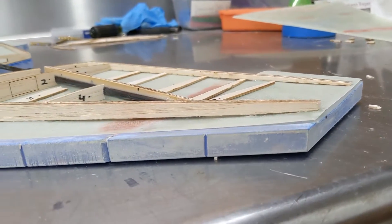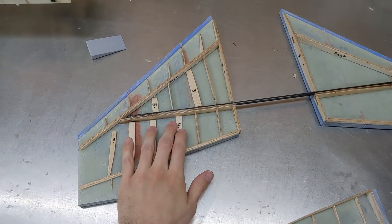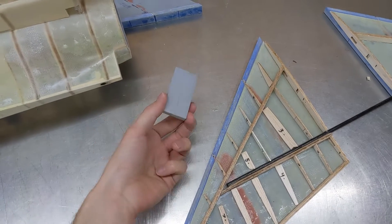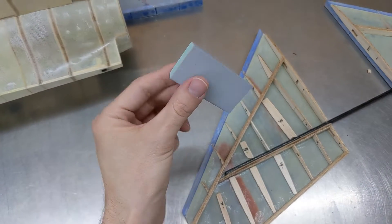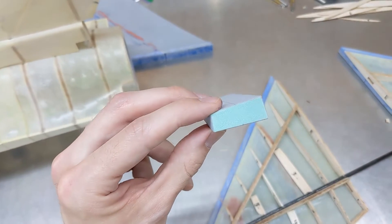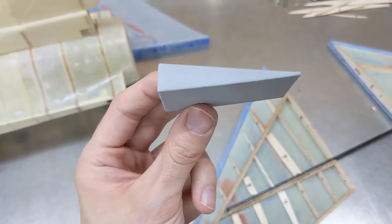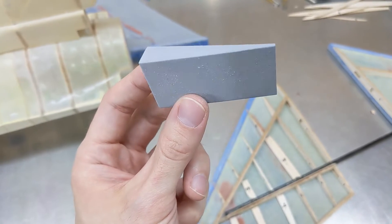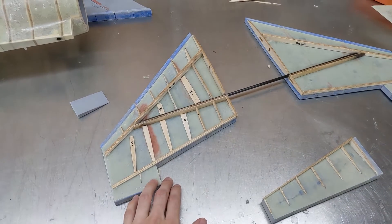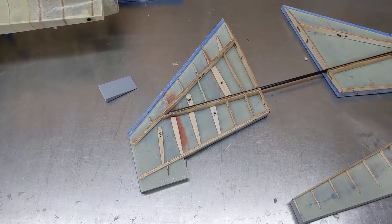There's no way I can use this because the wing's just going to come out all messed up, so I will have to change plans. I think I'm going to abandon the idea of using fiberglass for the wings, and instead I will 3D print them. I just started printing with lightweight PLA. I've been really impressed with how it comes out — it comes out super light, it's really easy to sand, it paints really well. I think I'm just going to redesign the wings to 3D print them. It'd be way too much work to re-attempt everything, especially with the summer here — these 3D printed molds are just going to keep expanding and contracting.